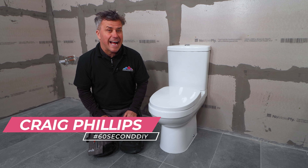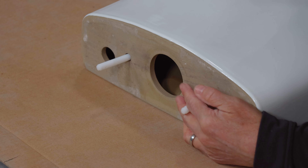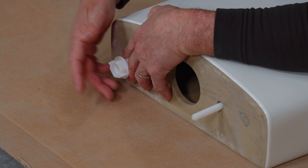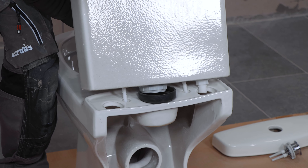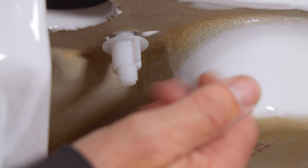I'm going to show you how to fit and plumb an entire toilet system. Start by installing all the components in the system. Slide the two bolts into position. Fit the rubbers onto the filling and flush valve and place them into position. Then tighten the bolts over the bottom by hand. Sit the system on top of the rubber washer and slide the two bolts into position. Apply the wing nuts below and tighten these up by hand.